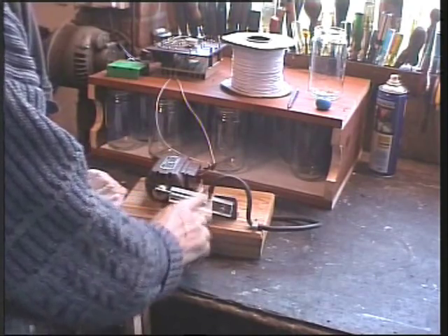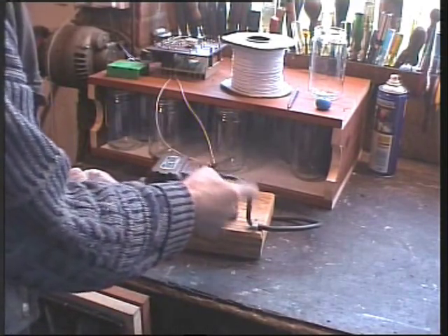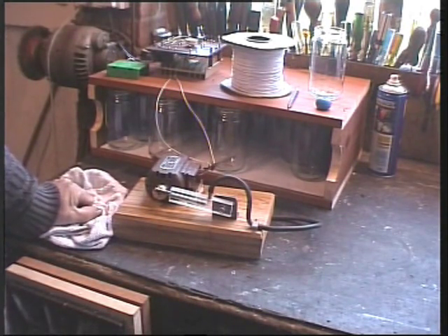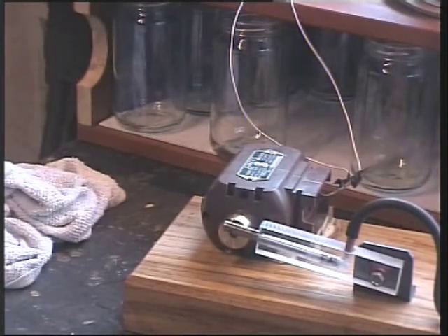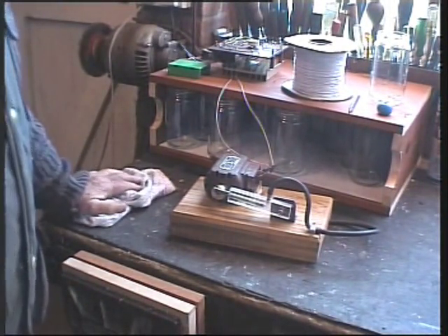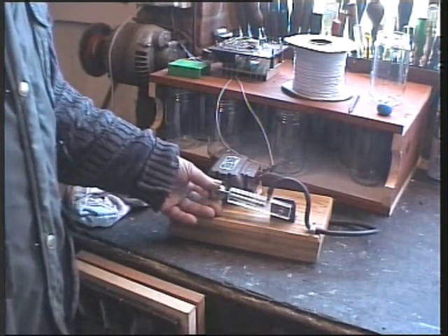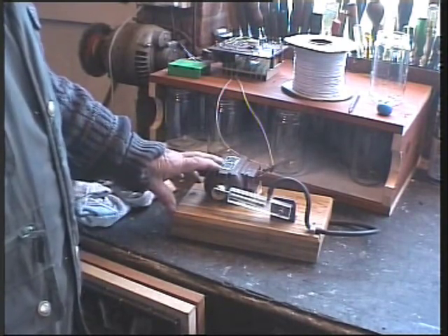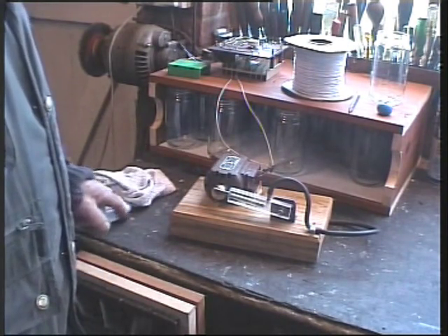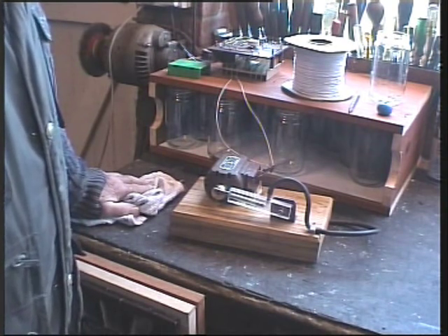This hose is necessary to be rubber in order for it to oscillate, but there's a certain amount of energy lost in the walls of it. The point I'm trying to make — and I wish to push this point very firmly — is that for maximum efficiency of these air engravers, there's a sort of a resonant narrow peak where they go from working good to working absolutely superb.